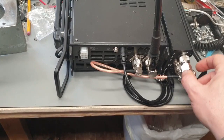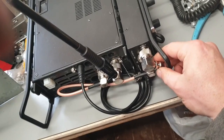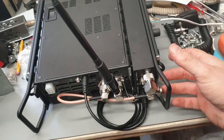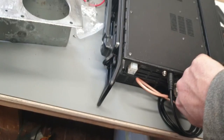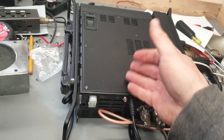I've got this little factory right-angle coax pigtail going over to the auto tuner, and then it comes out into a UHF to BNC adapter. I've got a little dirt cover on there to keep stuff from getting in it. The idea here is to make like a portable random long wire that we can throw over tree branches in a portable situation, and then it'll just plug in there if we're operating HF. There's a similar thing here - this is an HT antenna plugged into another one of these right-angle UHF to BNC connectors so it can be installed and extended, with the power on the radio turned down to 10 watts - all the antenna is supposedly rated for - so you can operate on 144 and 440 without an external antenna.